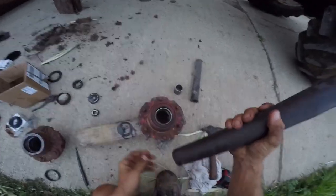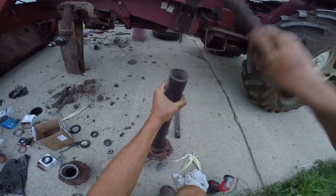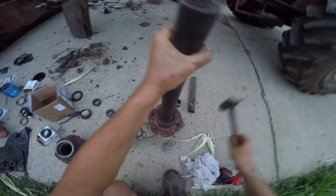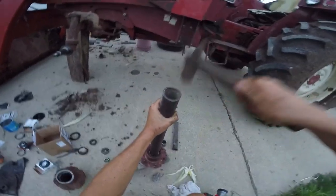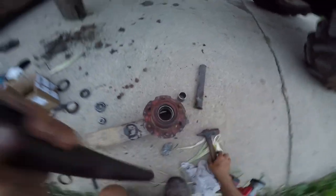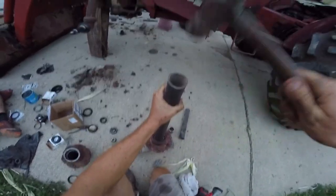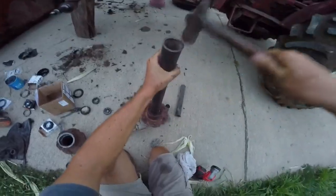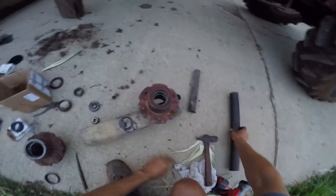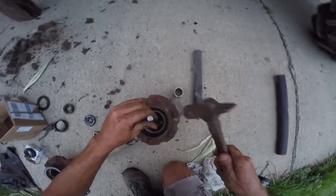I've got a lovely piece of pipe and it about fits in the race - it's not quite big enough to rest on the edge but we only have a quarter inch to go. Tapping a circle sounds like we're using a post driver - makes the chickens mad, it's loud. That almost sounds like we hit bottom - not quite, still a little bit of gap. We're starting to drive this race down into the hub. Sounds like we're there - okay, flip this back over. I like two taps - this is coming up on number three. There we go.